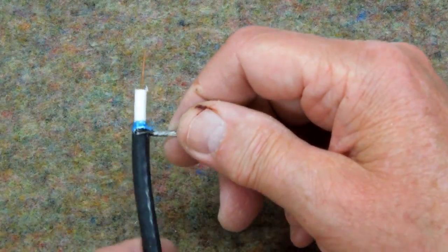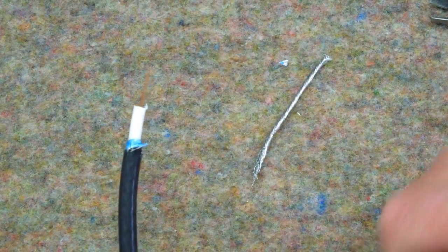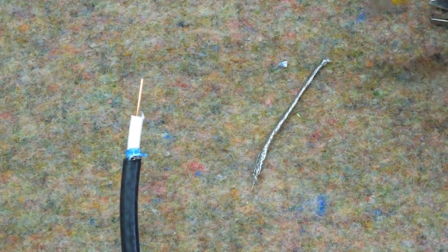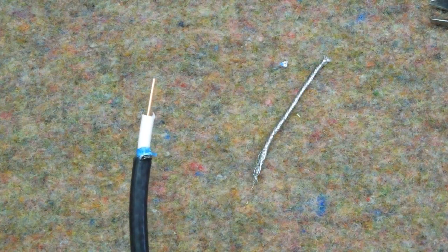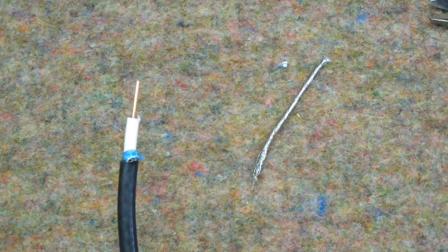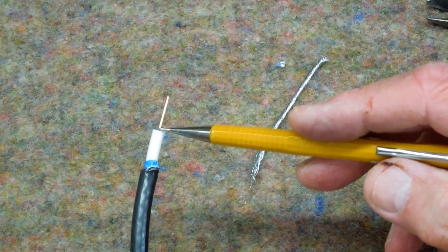On the other end of the wire that was outside, I cut this off. I soldered the original purple wire to this and put some heat shrink on it. The only reason I put the original antenna wire on here is it was a flexible wire — this coax wire is very stiff and is prone to breaking or getting kinked. The original wire was very flexible and not as likely to get damaged over the years. If the shield is grounded you will need a length of wire soldered to this copper, roughly equivalent to the length of the original antenna wire you removed from the door opener.